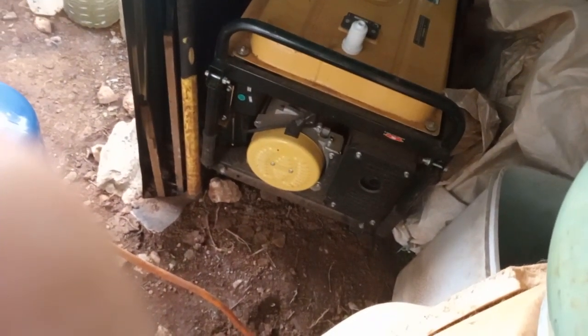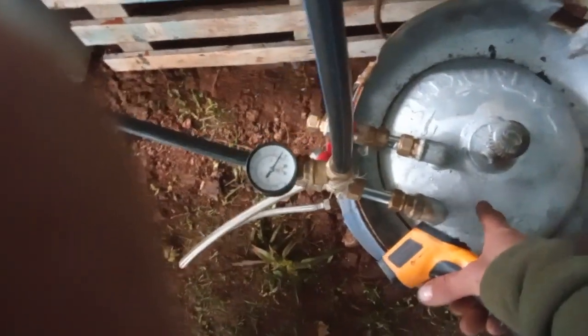But hey, if I close it — I don't know if you can hear it — I can still hear that this pipe is sucking in air or steam, whatever is left. It's probably because this line is not big enough. You actually want this vessel to be directly connected to the other vessel, extracting the heat right away and looping the output through it or something. That will be another design.